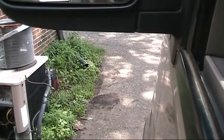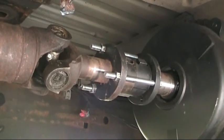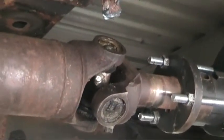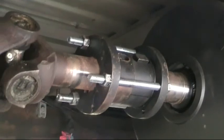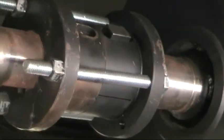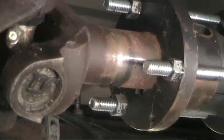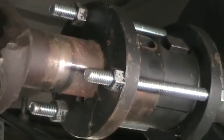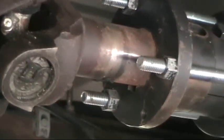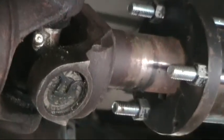This is the motor — you can obviously hear the cooling fan — and this is how it's coupled to the drive shaft. It's just two bushings bolted together; it acts as a coupler. The yoke is pressure fitted. The first bushing was heated to expand out when the yoke was inserted, and then the bushing clamped down on it. It seems to work really well that way.